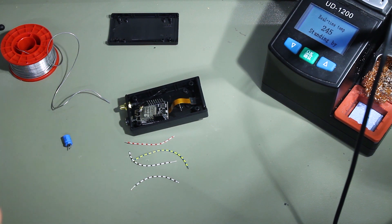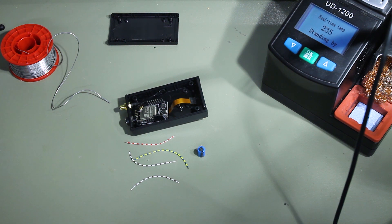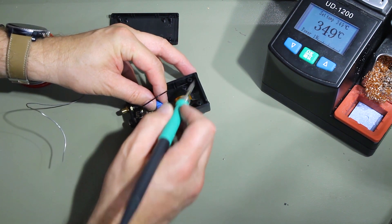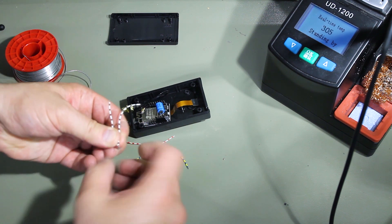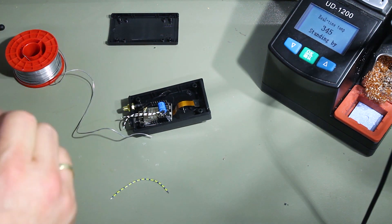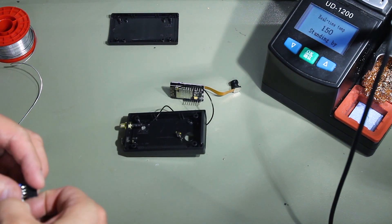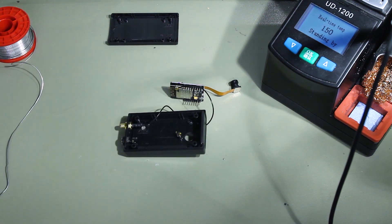The wiring is not complicated — it only takes four small wires and a capacitor of at least 100 microfarads, 5 volts or higher. We're going to use the capacitor as a buffer on the power supply. Put some tin on there and carefully mount it. We don't need to create a PCB with these little components. Next are the ground wires — I prepared two because we'll be wiring the switch and power connector together. Then the plus 5 volts and the power hookup. For the switch I'm going to twist the wires, because I love twisting wires.